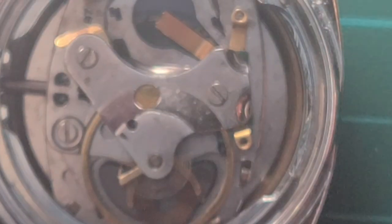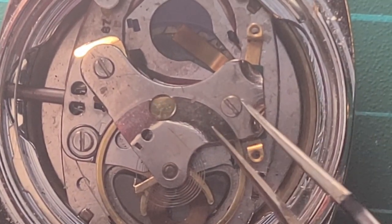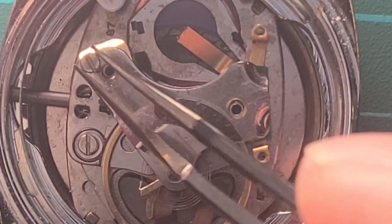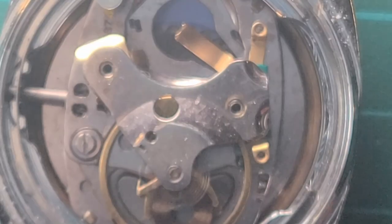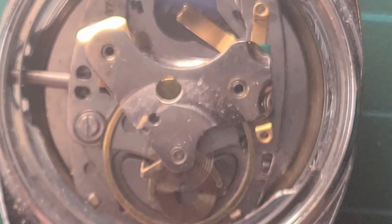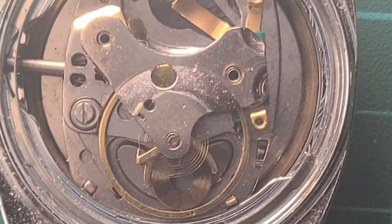Now that the shunt bridge is removed and the screw for it has been replaced, all you got to do is unscrew the two screws holding the balance back in. However, you do need to keep in mind the length of each of those screws and their location. This will matter on some Timexes, as getting the positions of these switched up might interfere with the day-date mechanism, and it'll do that primarily by pressing the screws against the actual day or date discs.